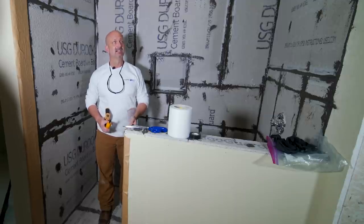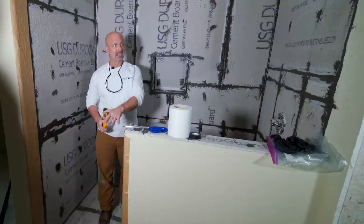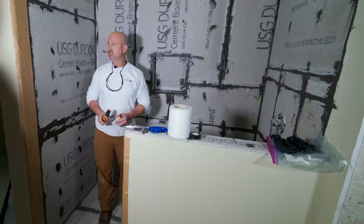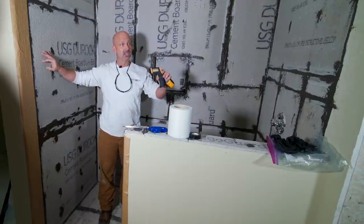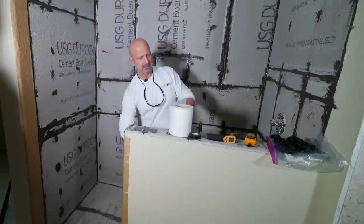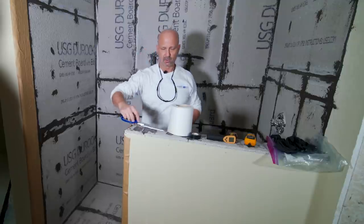This is an awesome beast once it's cured up. Wipe your feet off — it's raining outside and we want to make sure we don't track any moisture in here. We want to make sure this isn't sweating. The temperature readouts are showing that we're in good shape. Air temperature is above our 50-degree minimum. We're good to go. I'm going to show you how we're going to do a corner insert as well.